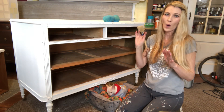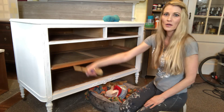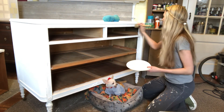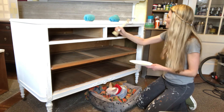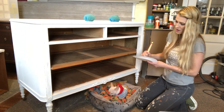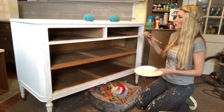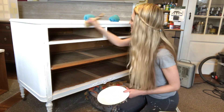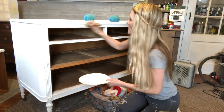Work in small sections — that's an important point with waxing. I'm going to start with the frame of my dresser, going all the way around, and then buff it off. You can be a little aggressive when you put it on. You'll notice that distressed parts get a little darker, and if you have a colored piece — yellow or blue — the color will darken slightly when you apply the wax. This helps you visually see where you've applied it and where you've missed spots.